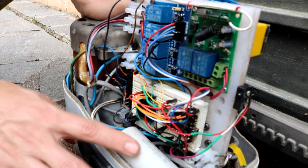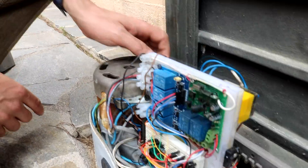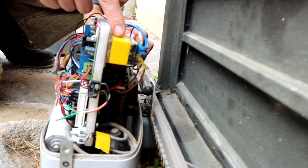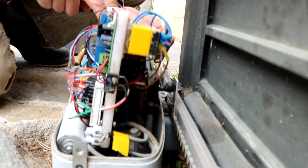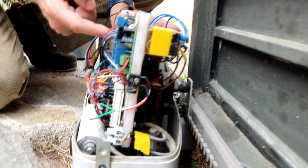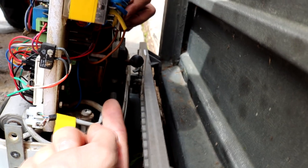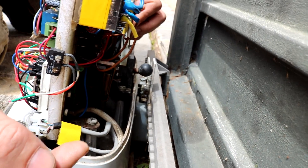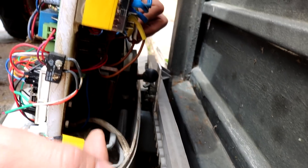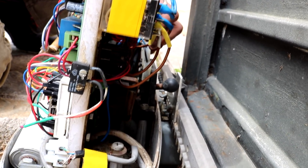This is the capacitor for the motor — the original capacitor. The motor, of course, is a powerful motor to move all the weight of the door. On the other side, you will find the 220V relays — they are used to power the motor directly in both directions, and they are commanded from the low-voltage Arduino relays. On the lower part, you will find the trafo, which I am using to supply power to the photocells and the radio module, plus another little power supply to directly power the Arduino Nano and the OLED display with 5 volts.